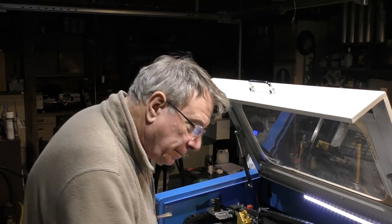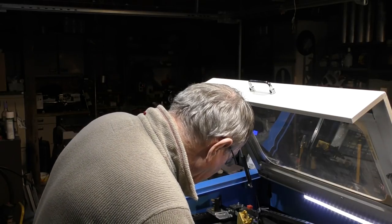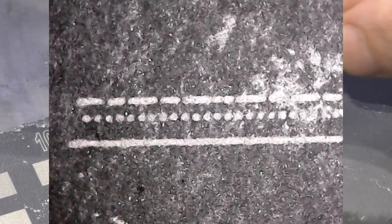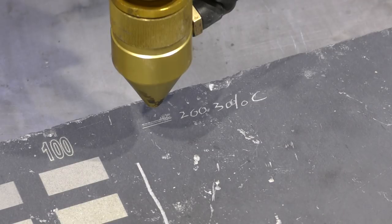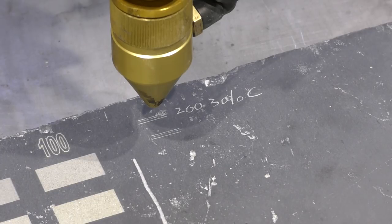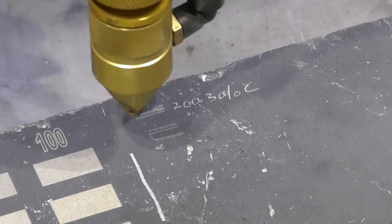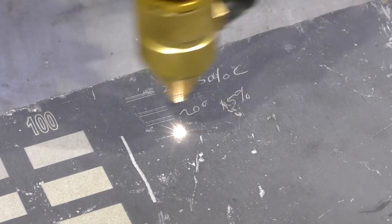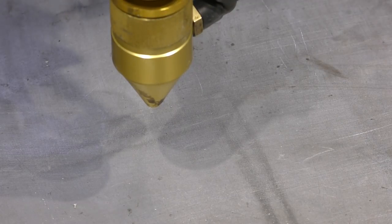We're using a 2-inch lens here and we need to set the focus to about 17mm. We'll go and have a look at that under the microscope - the result is looking quite good, but I'm hoping that at 400 we might get separation on this bottom row of dots. The bottom line of dots is slightly thinner overall but we've lost the hint of separation, so we're going too fast. We've now reduced the power to 15% and 200mm a second. We've still got dots that are joining up, so the dots are still 0.2 diameter. If I drop the power to 13%, I'll know that for this tube I'm truly working in the high frequency impact engraving zone, or the pre-ionisation zone for the tube. They're really nice small dots but they're still running into each other and still 0.2 diameter.